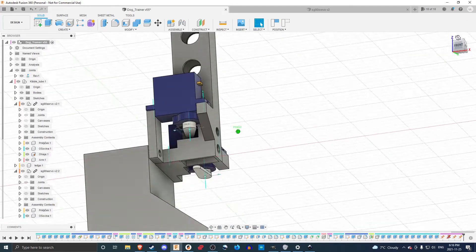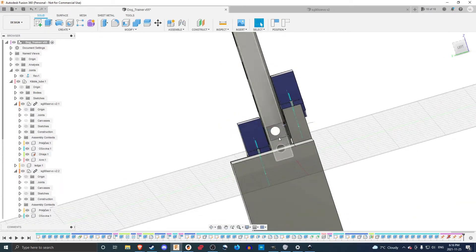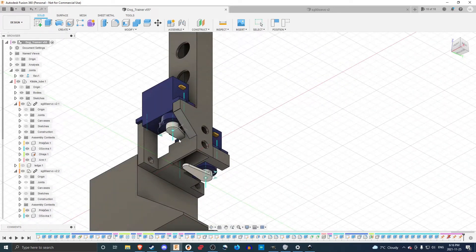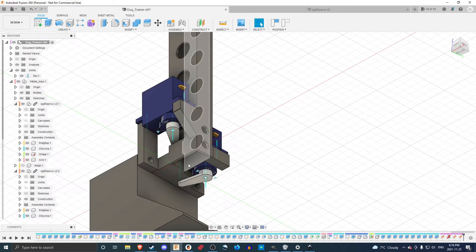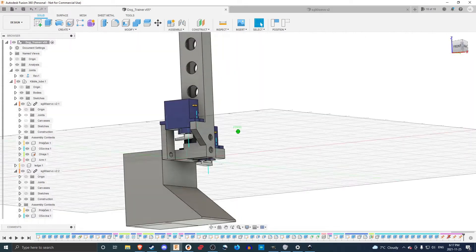I'm using just another servo arm, and there's a cutout in the tube so that the servo arm can swing right into the kibble tube. This works kind of like an airlock: the second servo arm clamps the piece of kibble that's second in line, holding it in place. Then we open the bottom, dispensing the piece of kibble immediately below — the first one, the one on deck. That dispenses out. Then we close the gate again and open the second servo so the whole stack can shift down one. We just repeat that process every time we want to dispense. This was much more reliable in getting one treat out at a time.